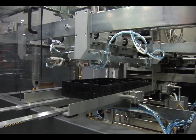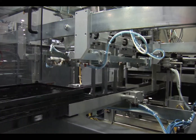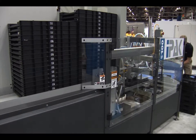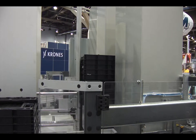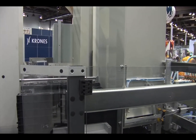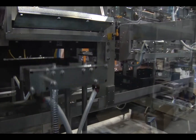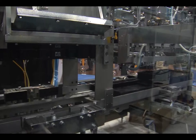So obviously there are cost and sustainability advantages to that. The way our machine works is we have multiple hoppers to maximize the capacity of the flat blanks in the machine. They feed to a central hopper where they get lowered down onto the transfer conveyor. The first motion erects the four side walls, and the second process of the machine locks the locking tabs on the end of the trays into position to complete the forming of the RPCs.